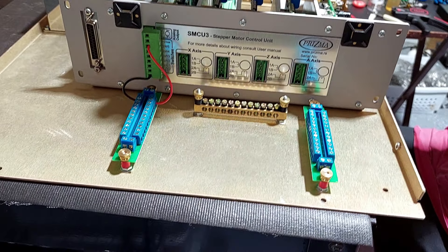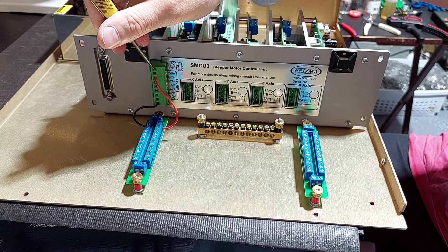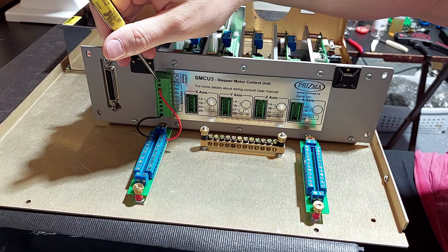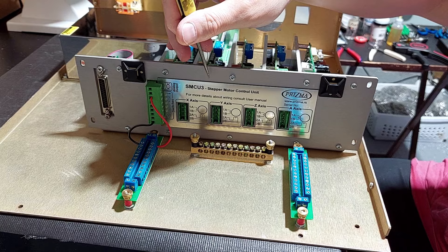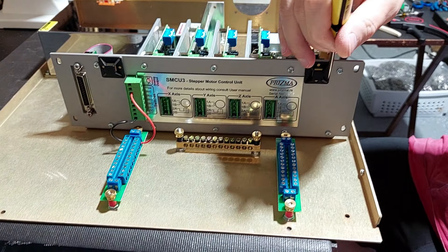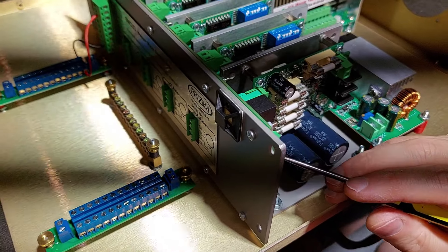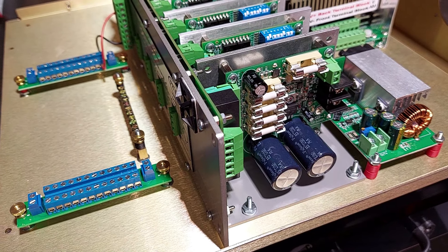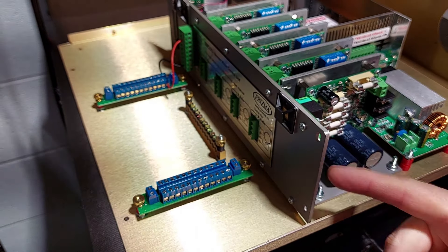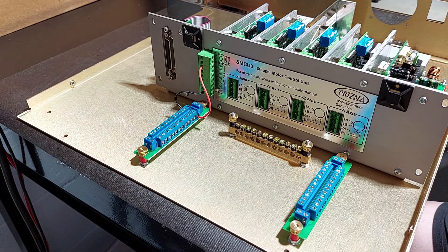Even our ground bus placement was engineered carefully — I mounted it low enough so we have proper clearance where the plugs are for our drives. If you make the ground bus too high or put components in the way of other components, it's going to bite you. I also put wire tie hold-downs here so that when we run our VFD wiring, it naturally comes to the top of the connector — two leads coming in and two leads with the ferrite already installed coming over to the terminals.